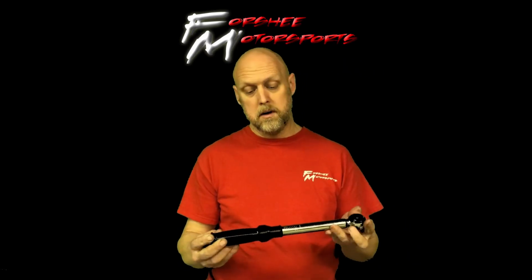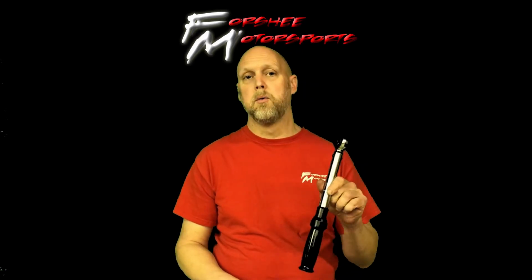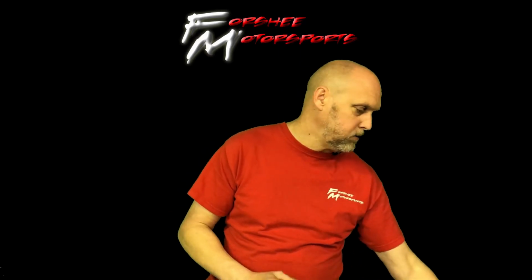The other one you really need is an inch-pound. This is going to be for doing some of the smaller critical bolts like your cam cap bolts. If you get those things too tight, you're going to seize the cams up. If you get them too loose, the cams are going to beat the bearing surfaces out. So you've got to have that. So, that's some of the tools that you need.